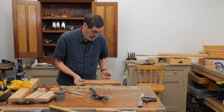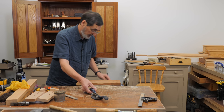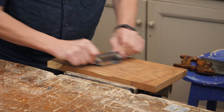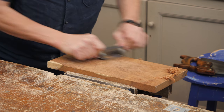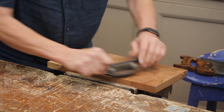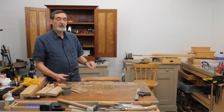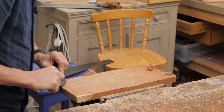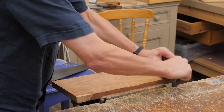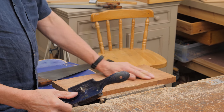Let's see how we did — let's see if we can get some shavings. I'm shaving here on mesquite, which is just about twice as hard as oak. We are getting shavings — a little bit extra on here — and this is absolutely glass smooth. That's how I would recommend that you sharpen your number 80 scraper. It'll stay with you forever. And that smell of mesquite is wonderful.